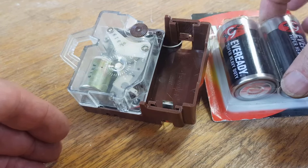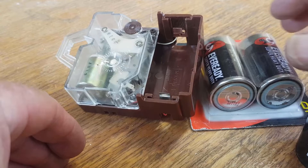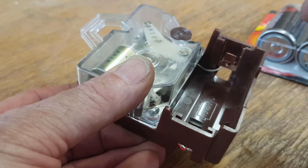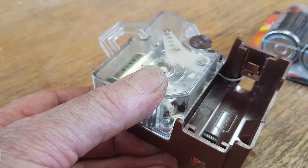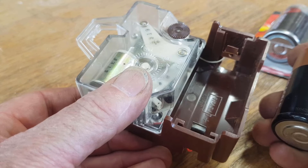I've got a battery for it and I've also brought a couple of others home from the shop. I'm going to say this about batteries: spend the extra money and buy a good one - buy almost the most expensive battery in the rack at the store because it works out cheaper in the long run. You saw the corrosion in this - it happens in toys, it happens in all sorts of equipment, and especially clocks. Cheap batteries will leak acid and pretty well destroy a lot of things. Don't skimp on batteries - buy a good quality one and you've got much less chance of any leakage of acid.